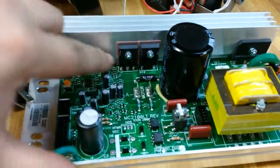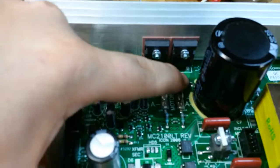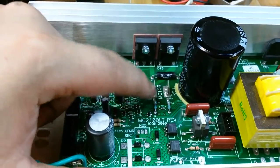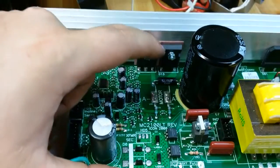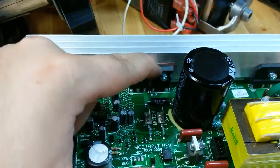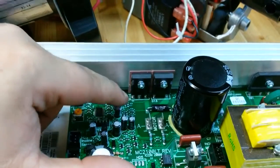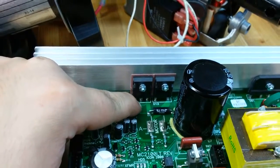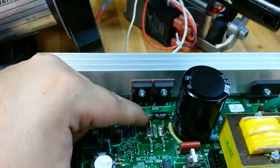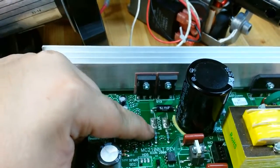What we're going to do is use this pin here. The way that it goes, you can see that this one here will go to this diode, and that'll go across, I believe that's a diode, pretty sure it's a diode, and that'll go across underneath here to one connection, probably this one right here, and this is actually a diode. Not sure why they're using another one, but there's got to be a reason for that. 600 volt diode at 30 amps, and that provides your negative power, and then this one will provide your positive power. That one is going to be your source, I believe. I would have to, no, so, okay, that makes sense. This is the capacitor. This provides the clean power through the diode, so it doesn't feed back through the circuit into the source. That is your discharge, so that'll go underneath and connect to here.